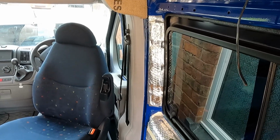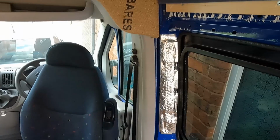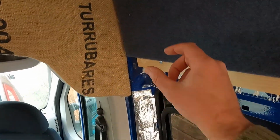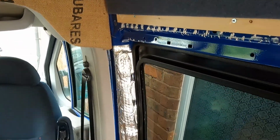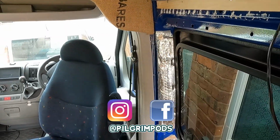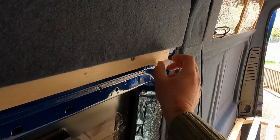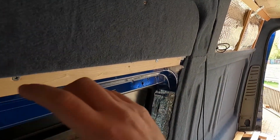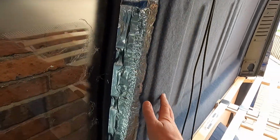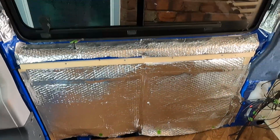And of course, that could be easily sorted out numerous ways, but personally I just thought that packing it out 12mm with battening, cladding on top, if my measurements are correct, it should completely remove that gap. And we'd have the added bonus of that 12mm enabling the cladding to pass past this pillar straight to the bed for one nice even continuous length.